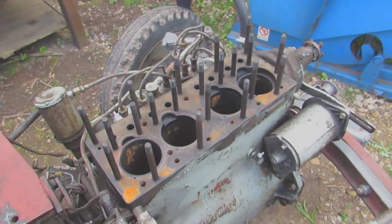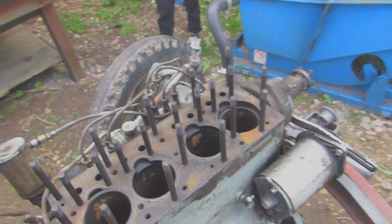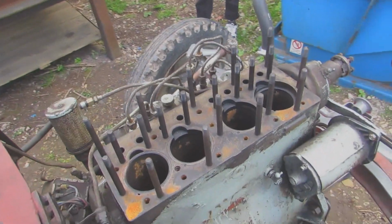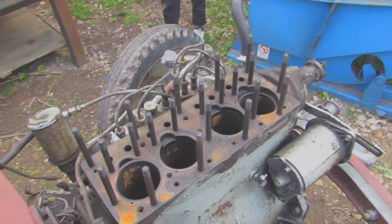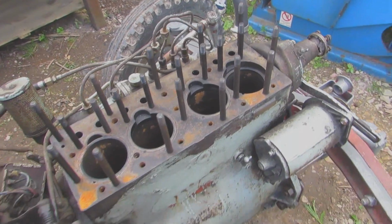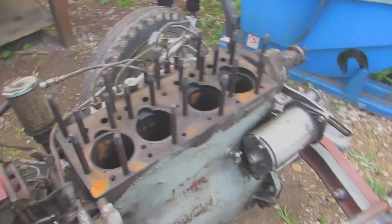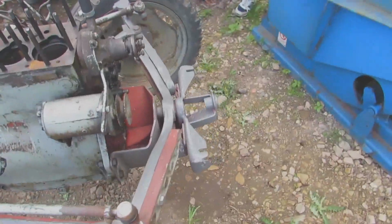We've got a new gasket kit, so we've got all the gaskets. The block's fine. We're going to get the crank re-white metalled and machined, so the crank will be refurbished. New liners, everything, the whole engine kit. So basically it'll be a brand new engine, but we are still keeping the standard Grey Fergie engine in.